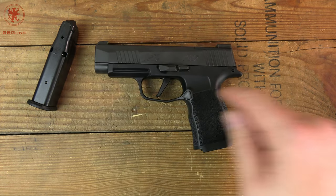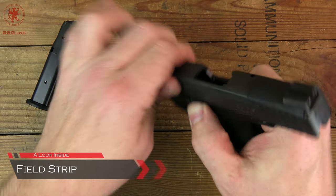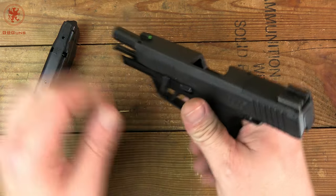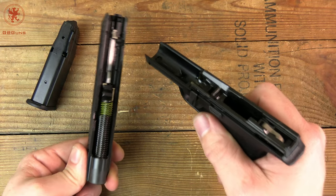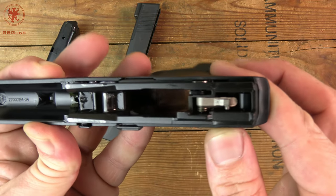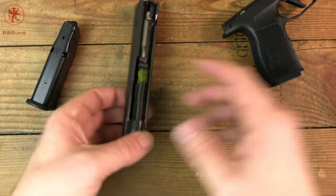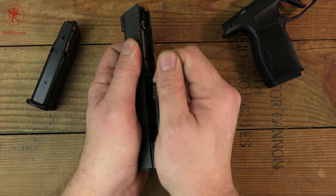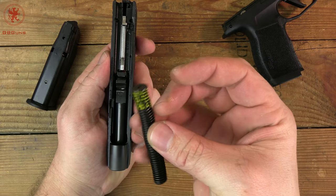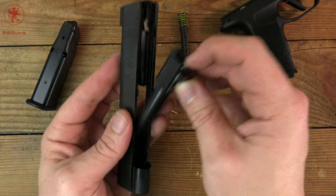Next we'll field strip and take a look inside the gun. To field strip the P365XL we'll check for clear one more time, lock the slide to the rear — which it does for us — and with the slide to the rear push down on this lever until it stops. Let the slide go forward and you don't have to pull the trigger, which is pretty cool. Take a look at the frame construction: we've got that internal chassis system that has become so popular — very neat and clean construction, not a lot of excess, which is part of what helps keep this thing so light. To get our barrel out we'll remove the recoil assembly — and you can see it's color-coded. They may use different colors for different load usage. The oil does seem to be eating away and removing that paint, so I might have yellow fingers.